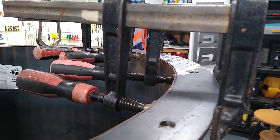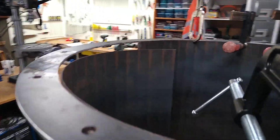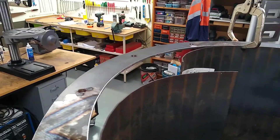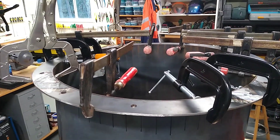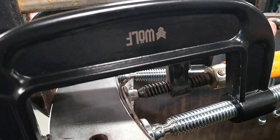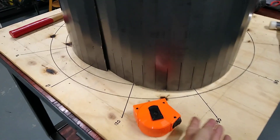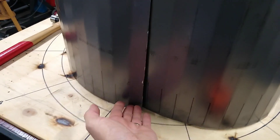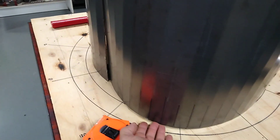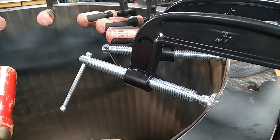That's actually not too bad - I'm pleasantly surprised. I was expecting this to throw a curve ball at me. I guess the tricky bit comes over here. The top of the cylinder is all clamped to the flange. However, it is beginning to warp slightly, which is not really what I wanted. I did manage to get the two ends together and they clamped firmly. But if you have a look, the bottom of the cylinder is still way out of shape, especially where the two ends meet together - this bit here is bulging out quite a bit, and the flange is also beginning to distort slightly. So at this point the only way forward is to just tack weld the cylinder to the flange at strategic places.